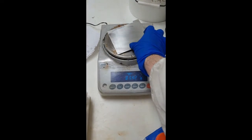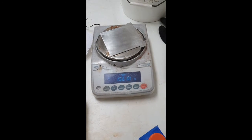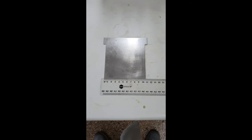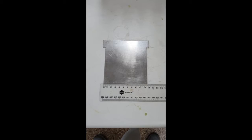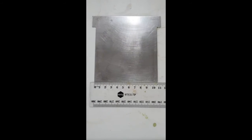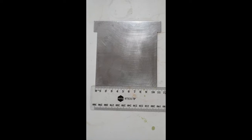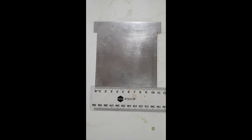So let's measure the weight of our cathode — this is roughly 156.1 grams. Let's also measure the length of the base of our cathode. We need this in order to calculate how much current we need to run through the cell at our specific current density. I've measured this as roughly 10.7 centimeters.